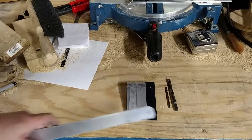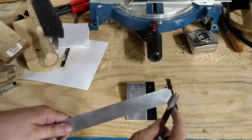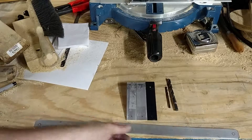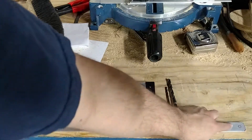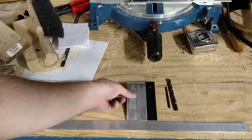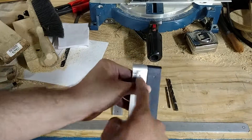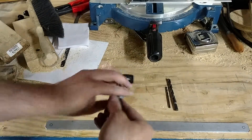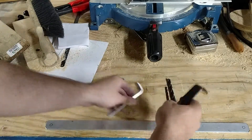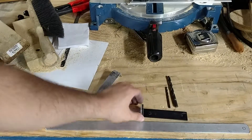Hello, welcome back. I've gone ahead and deburred all the edges with a file so that they're all nice and smooth. And I went and marked out where the holes should be. Same with these pieces here, you can see I've marked out where the holes ought to be. I did that by just laying it like this and then taking a marker and going across, and then doing this to transfer it that way too. So that was pretty simple.